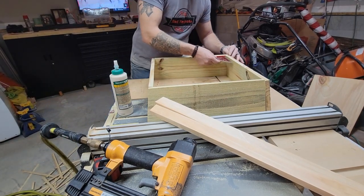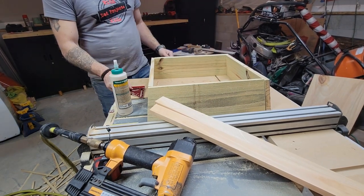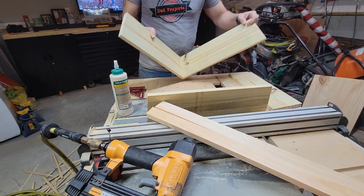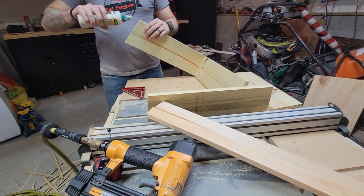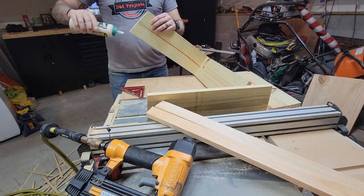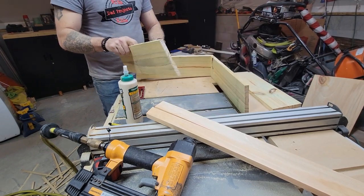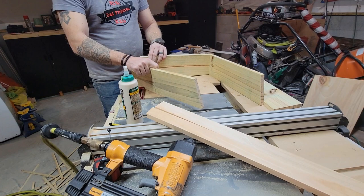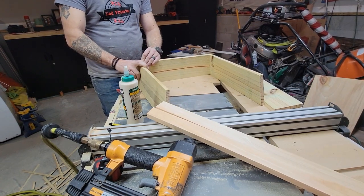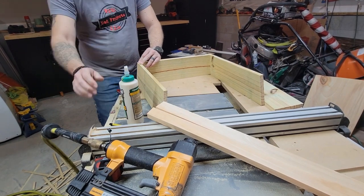That's not bad - so I don't know, let's try it that way. I'll set this one up. Plus a little dab of good old Titebond 3 - the green bottle. This board has to go on the outside of this one. Let me get this set up. I think this might do it - probably not - but I know someone out there on YouTube will let me know if it isn't right. So there we go, let's build another one of these - this is our top ring. We'll very gently set it down over here because I only used one-inch brad nails, 18 gauge.